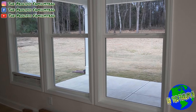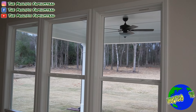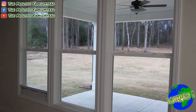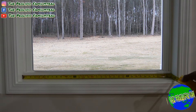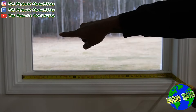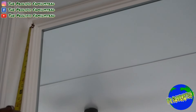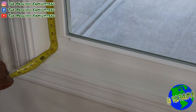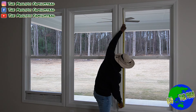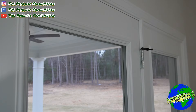Now I'm going to show you how easy it is to do this step by step. Trust me, this is super easy — I'm not Bob the Builder and this is my first time installing blinds, so I know anybody can do it. The first step is measuring your windows. This step is super important because you have to make sure you buy the right size blinds. Measure on the inside of the window from the top of the inside to the bottom.